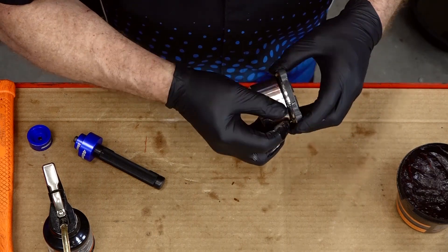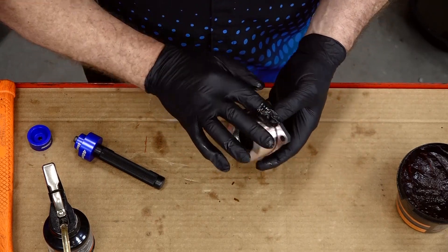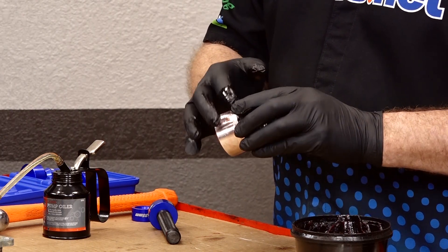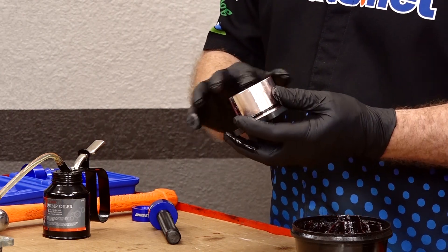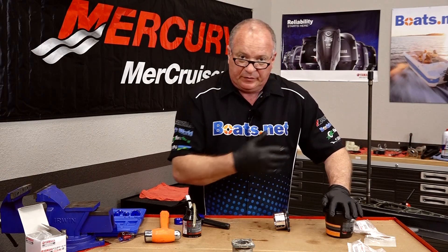Just for kicks, go ahead and put a light coat of grease on all the metal surfaces. So when the next time comes around, hopefully this will cut down on how much corrosion is going to happen and give a better chance of getting it to pull free. So this is set up and ready to go — let's get it reinstalled.